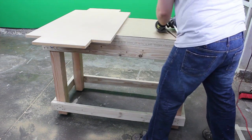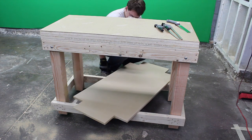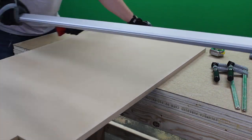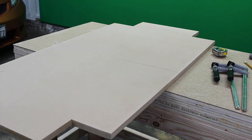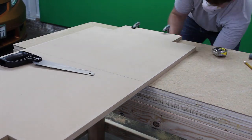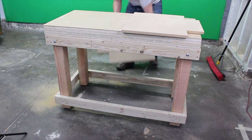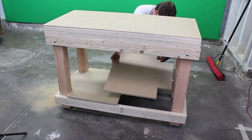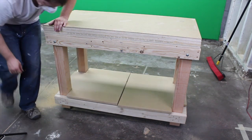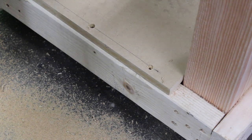All four corners are now cut. Let's go put this thing in the workbench and finish this up. It doesn't fit. In order to better let us put the shelf in, I've decided to bisect it — cutting it in half — and clamping it up to the work surface again. Using an actual crosscut saw rather than a pole saw this time, cut it in half and it's pretty easy. There are the two halves. One half goes in — if it's nice and tight, good to go. A little gap in there, but it's all good — it's just a lower shelf. The rigidity of our base is going to come from screwing this MDF into the bottom frame. Just take some one and a half inch drywall screws, drive them in, and countersink it so there's nothing to hook on when you're storing tools on the shelf.